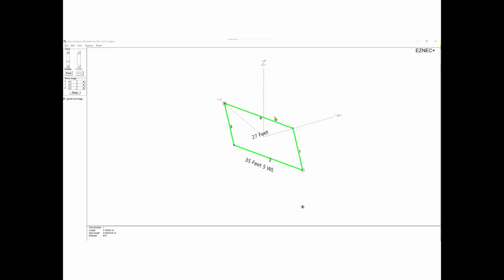Okay, so moving along, here's what the antenna looked like. It consisted of four wires. Each one of these side wires was 5 wavelengths long, 5 times 6.5 feet, or whatever 2 meters is, 35 feet. So some of the numbers I gave you earlier were a little bit off, but it's 35 feet this way, 35 feet this way, 35 and 35. And here's where the 300 ohm twin lead goes, right here. And the characteristic impedance, the 400, 500 ohm resistor goes here. And that's what makes it directional.